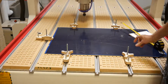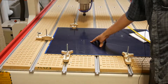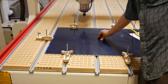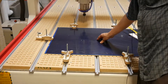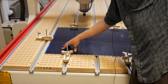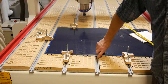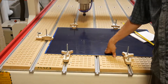For the Z depth, you can either zero off against the bed itself or against the material. If zeroing against the material, zero from somewhere around the center of the bed rather than the edge, because areas clamped down will actually be lowered slightly from the rest of the material. I'll zero off in the center area to ensure enough depth in my cut. With a good spoiler board underneath, I'm not going to be cutting into the bed of the CNC machine itself.